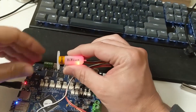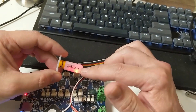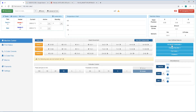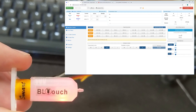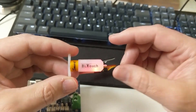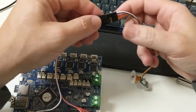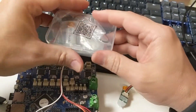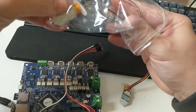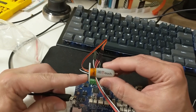Let's look at how this is supposed to work with the genuine BL Touch. I'm going to unplug the power, plug it back in, and we see that it goes through its self-test diagnostic to make sure everything works — and once it does, it retracts and stays red. Here on the computer I'm connected to the board. I'm going to go to my BL Touch commands, deploy the probe, and we'll see the probe move as I deploy it and as I retract it. That is the correct functionality.